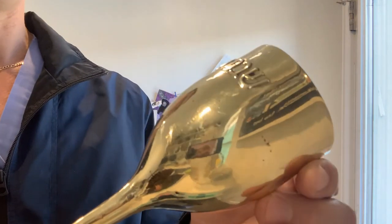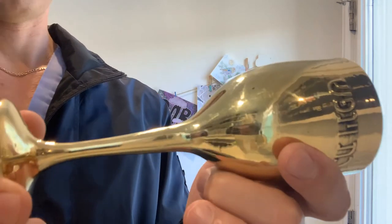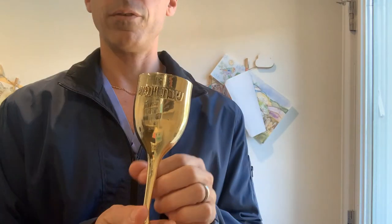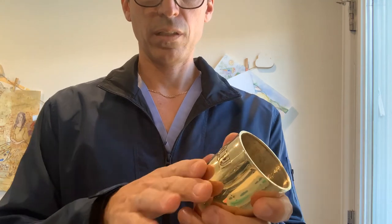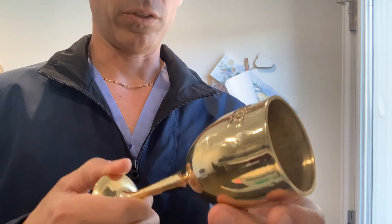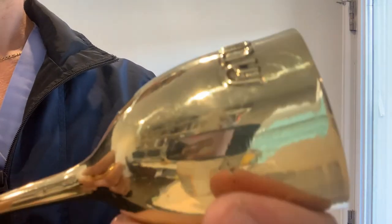You can see some of the imperfections up close. I did not use the vacuum during the pour and there is some porosity. The bottom came out really bad because I didn't use a riser, so I had to sand that down pretty heavily to get out all the imperfections. I used a polishing wheel after multiple types of sandpaper, and I even bought a Harbor Freight 2-inch sanding machine just to get the contour because it was too hard to do by hand. There are still some layer lines — this could be polished a bit better.